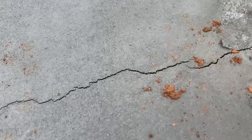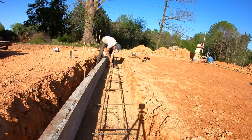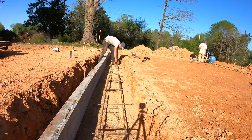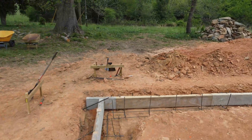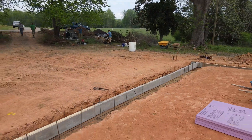If concrete pushes the unsupported rebar to the bottom of the footing, it won't be embedded in the concrete and it can't do anything to hold the concrete together over time — which is bad news for your house. If your foundation cracks, it can let water in under your home and start to decompose not only the foundation but the entire home pretty rapidly. If these horizontal bars come loose and get thrown sideways, the concrete is likely to crack in the other direction and bust apart. So we use steel rebar to hold it all together.